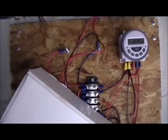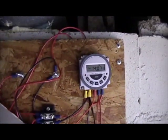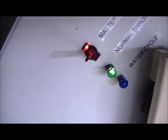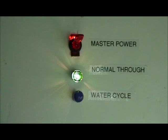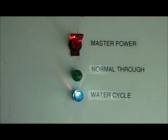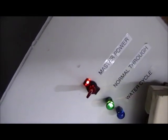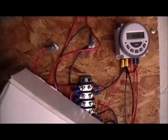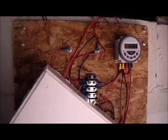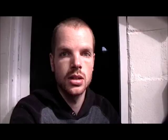The air pump is on all the time, just hardwired into one of these terminals. The water pump is hooked up to our timer, as are my totally superfluous LEDs. I do have a master power switch just for safety that'll cut off the power at that point. The 12 volt fan is also hooked up directly to one of these terminals but it has its own on/off switch so it's not on 24/7 if I don't want it to be. Setting all that up wasn't all that difficult, but finding 12 volt appliances to use in the first place proved a little tricky.